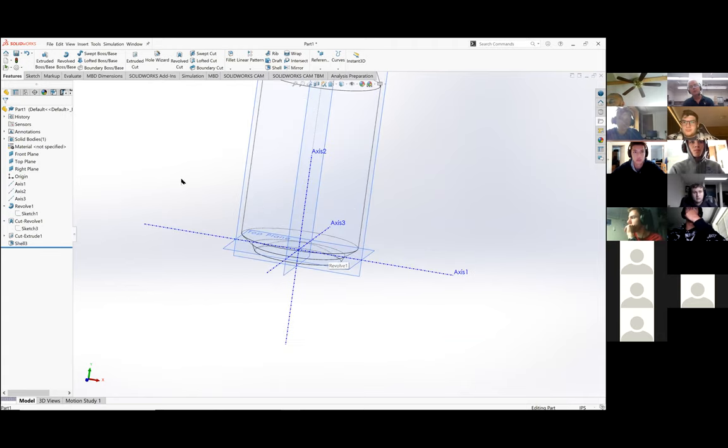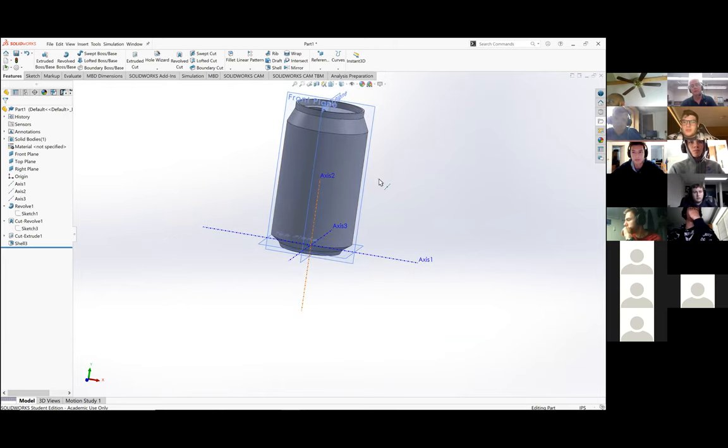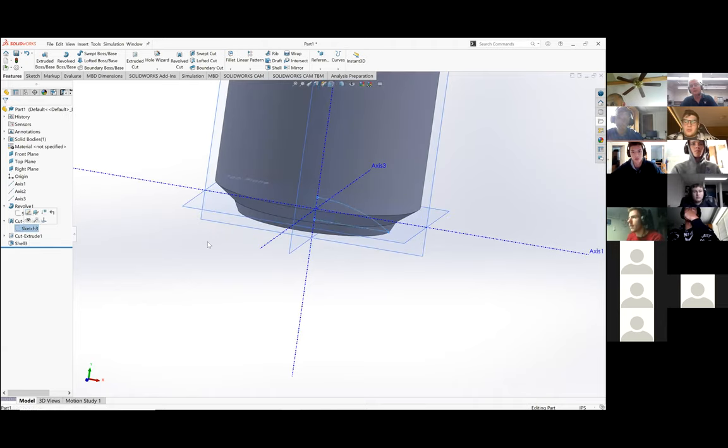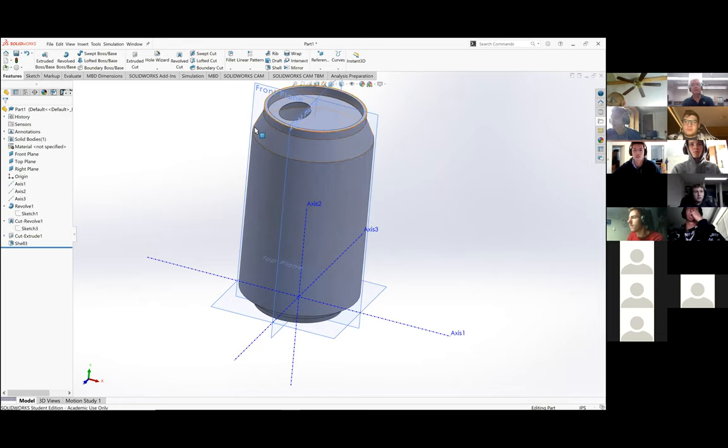Yeah. So the only problem I have with that, just theoretically, is on a Coke can, there's actually a rounded edge that the thing can sit on. Yours is going to be sharp, right, the way you have it drawn. So just put in a little horizontal line right there or something. Yeah, or end the edge of that arc further toward the center line. Got you. Okay. Yeah, because it comes to an infinite thinness right there, right? Exactly. The way I have it right now. Okay. Yeah. Other than that, it looks pretty nice.